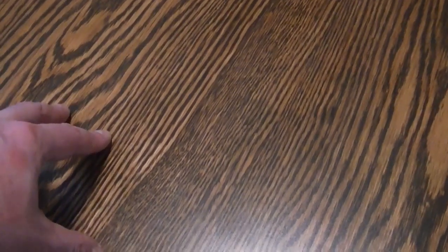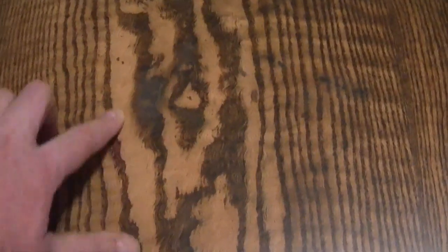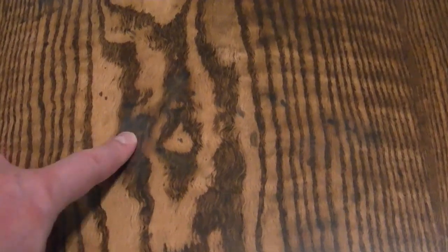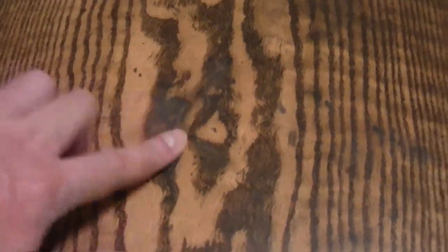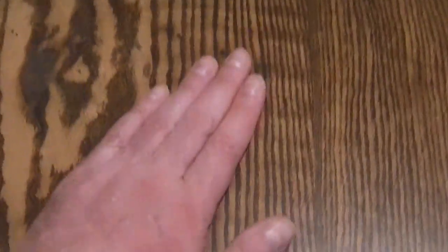As for the look, I like it. It's not perfect — some of the sanding marks showed through more than I thought they would. The recommendation was to use 220, but maybe I'd go 320 in the future or apply it more heavily. The only issues I've got are on this one where it was a more flawed surface, and in some areas where I applied the sanding sealer a bit thicker, it's a little cloudy. That stuff goes on really milky and in thin layers it looks completely transparent, but if you build it up thick it does get a little milky. The only other options were to leave a noticeable dip or plane down the whole surface to make it flush. As it is, I can live with that.